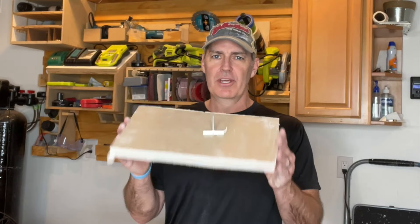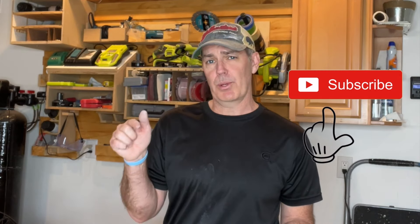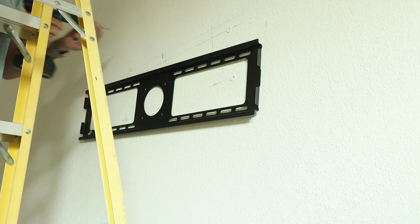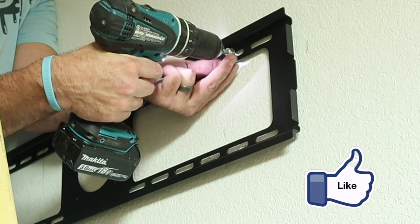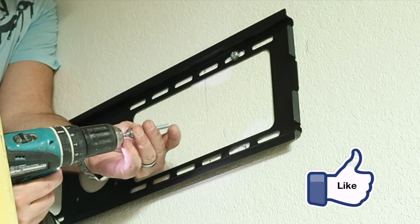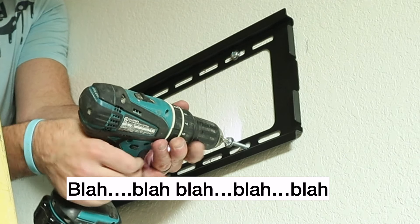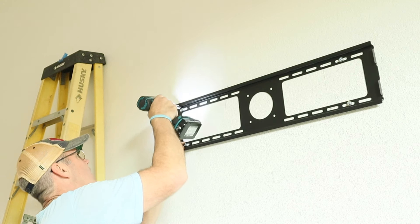I hope that illustration helped. There's probably a number of other products out there kind of like this. I'll leave a link in the description for what I used for this, including the washers and that lag bolt for your project. Back to the project — I'm just showing that I do use washers with these machine screws. I've already put in the flip toggles, and now I'm just securing those with the washers and the machine screws.